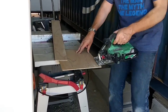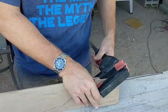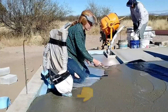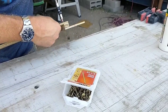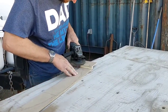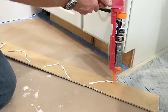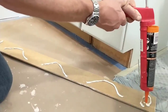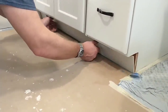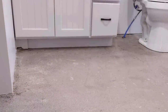Next up was creating a kick plate for the base of the vanity. It was more complicated than it should have been because the rough plumbing comes up in the edge of the cabinet right where the kick plate should be. I decided to create a little step out in the kick plate to cover up that unsightly plumbing. Otherwise this would have been a really simple flat piece of wood, but I've got a kick out created. April has already painted it the same color as the cabinets so it'll match nicely. I'm using heavy duty construction adhesive - the same stuff used on the metal trim - and it holds just wonderfully.